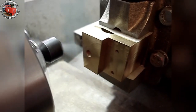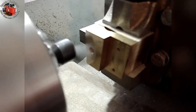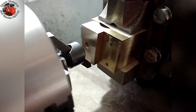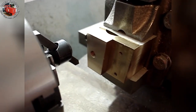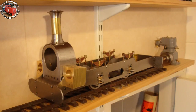Fly cutting using my old Emco Uni Mat 3 fly cutter. I need it to remove 0.4mm from the cylinder edges to clear the smoke box width. Cylinders screw to the frames with the smoke box in place. Back on the shelf. The next job is to drill the cylinder blocks for the steam chests.